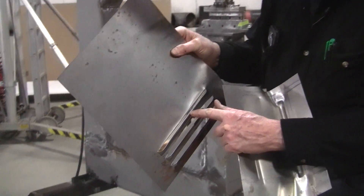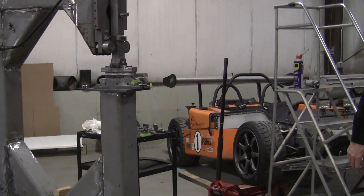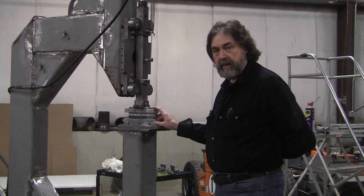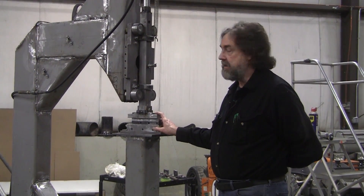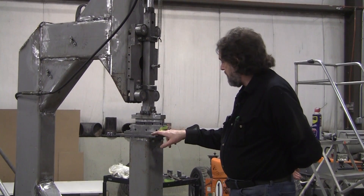The clearance would open up and the metal would ride between the blades rather than shearing off. It's a long learning process to get them just right. To do a louver longer than eight inches will probably require even more tonnage on the cylinder. Frank should get those adjustable stops in tomorrow, and that'll lock it — we should be good to go.